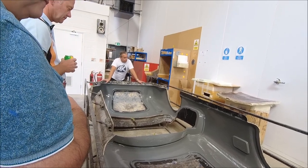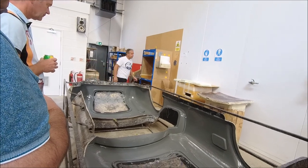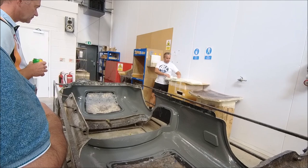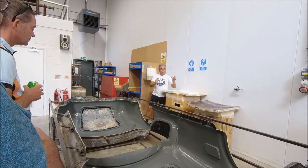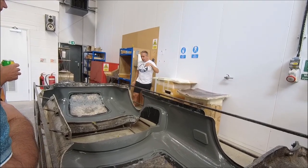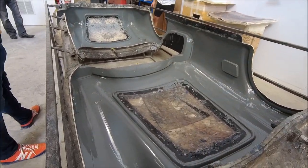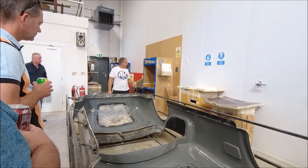And then on Monday, we'll start laying the glass fibre. So basically, got a bit of cut here actually. There's two different thicknesses. You'll have a slightly thinner one on first, which aims at getting it on the corners, it breaks down a bit better than the thicker one. And then once the two layers have been put on, we've got a thick crop.